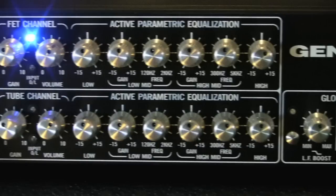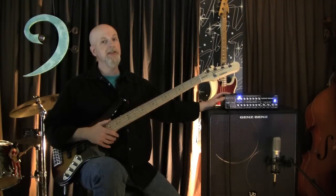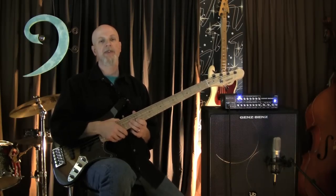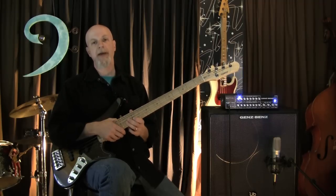There are two bands of semi-parametric mid-range. We've got three variable filters: bass boost, mid-cut, and high-frequency attack, all controllable via footswitch. Channel switching is also accessible via footswitch, as well as the ability to mix the channels together. Two important differences in the Shuttle Max 9.2 are the inclusion of PHAT, which stands for Proprietary Heat Abatement Technology, and 3DPM, which is three-dimensional power management.